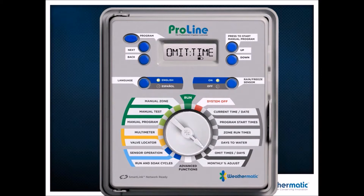So I don't lose any of the available water window. I could say never water on Monday, so I get a backup to my water restriction — I'm not in a situation where I might get a fine because I watered on the wrong day, because my controller doesn't know or I accidentally made a mistake in my programming. I get that water restriction in there up front. We have 15 event days — I could say never water on the 4th of July, or for a wedding, maybe an apartment complex, I just can't water on that particular day. The greater-than sign means the beginning of the no-water window, and the less-than sign means we're going to resume at the end of the no-water window.